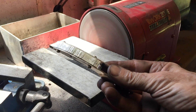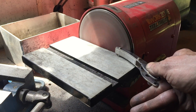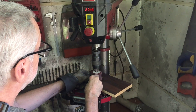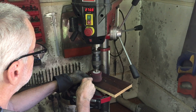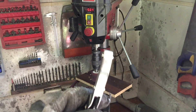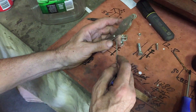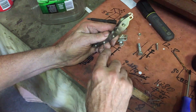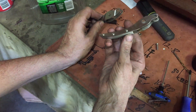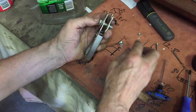The inserts also need to be sanded flat, and then a final touch up on the scotch-brite wheel to make them all pretty. I'm using M3 stainless cap head screws to hold all three bits together. This is how these parts go together — you can see how a straight bit matches with a bendy bit so you end up with the jaws in line.